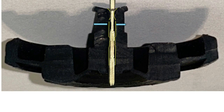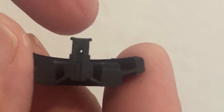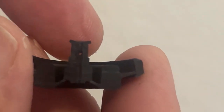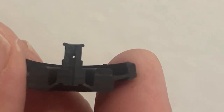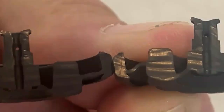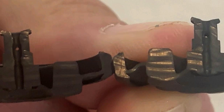You'll notice two little blue lines going out from near the top of that seal — those are holes in the seal. Going back to the cutaway, you can see right in the center of the upper portion of the seal there's a hole. As I put my finger there you can see it blocking off the light. There are two holes — one in each half — and those holes are also critical in the operation of this fill valve.